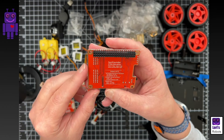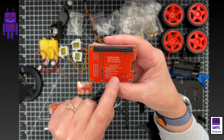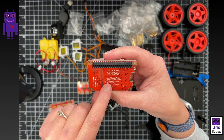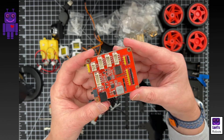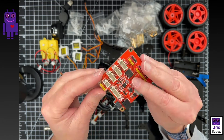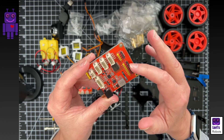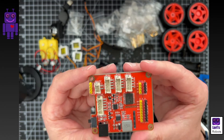And then this is the hat that goes onto the Raspberry Pi — they call it the Robot HATs. It has a step-down converter, so you can input 6 to 12 volts and it puts out 5 volts at 3 amps. It has an analog-to-digital converter, the PCF 8591 — an 8-bit converter — and some LEDs on it. This is the heart of the robot: that's where the power comes in, and it has an on/off switch. These pins will be usable with sensors, and here are some other expansion points the kit advertises as open source.